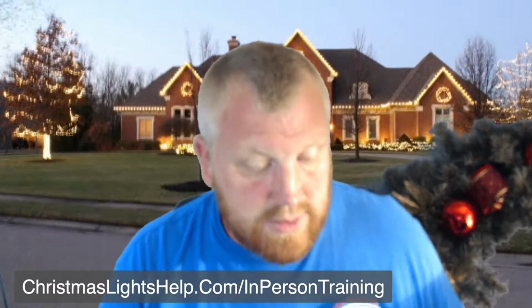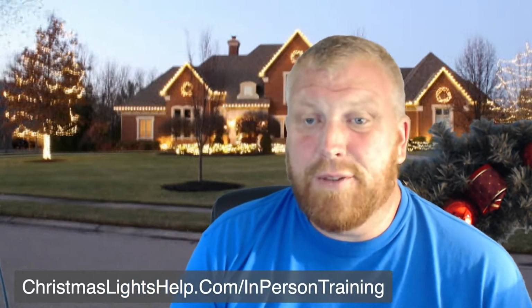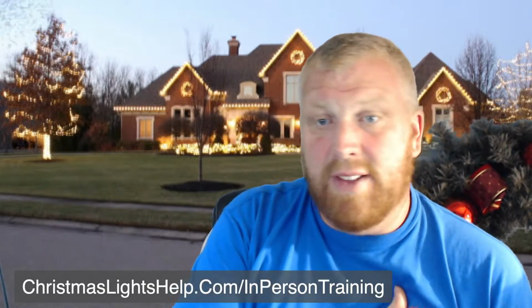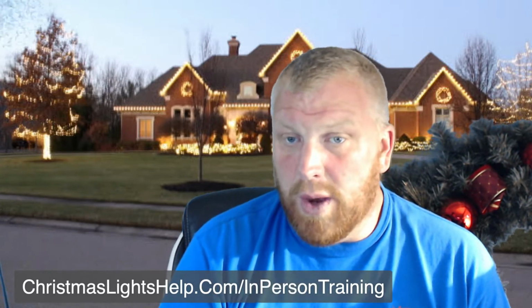If we had this house in the old incandescents, we would have had to find like 3 completely separated outlets off of different circuit breakers. We would have had to run electric over the house, into the back, into the garage, the whole 9 yards. And why is that? In the old days, with the C9s, you could only run 130 C9s and you were at 10 amps. This house here, I believe, had over 200 C9s, so it would have taken 2 different circuit breakers just for that.